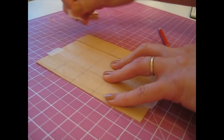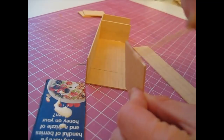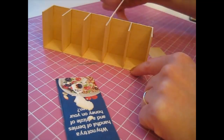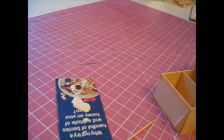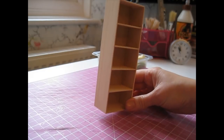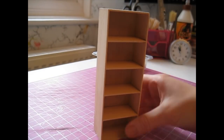I remove the tape and begin construction. Attach the side to the outer edge of the back piece, attach the top piece on the inside edge, then work your way down. Apply glue to the edges and attach your remaining side piece, then secure with masking tape until the glue has dried. Once you've allowed enough time — I left mine overnight — remove the masking tape, sand all edges, and sand face down so you have a nice flush front edge with no overhanging shelves.